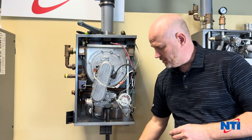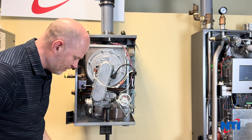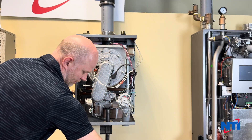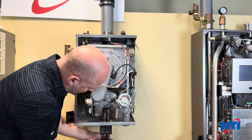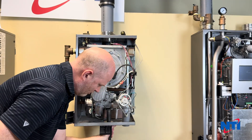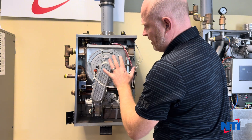The first thing you're going to do is power down your unit. Then we're going to disconnect the gas lines — shut the gas line off, grab your pipe wrench and your support wrench, and disconnect the gas line on the unit. This one's been pretty loosened, so we're going to take that off. What I like to do is remove this gas line from the bottom of the gas valve itself.